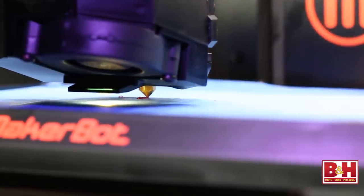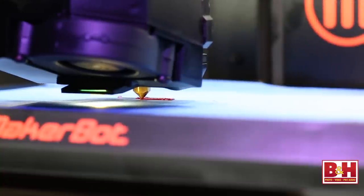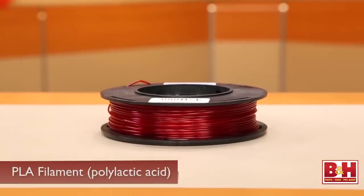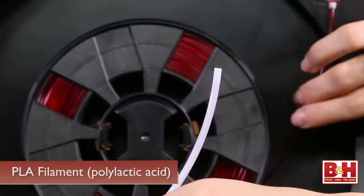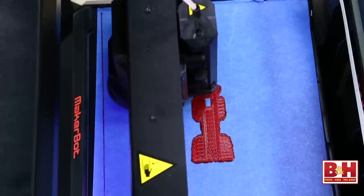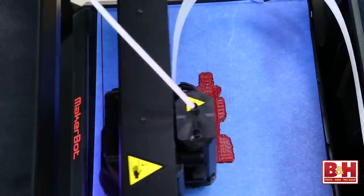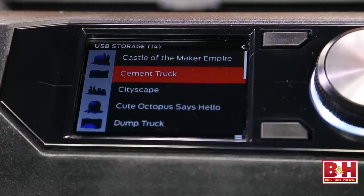So how does it work? Well, if you've seen a glue gun working, you know that a solid stick of glue is inserted into the back of the gun and passes through a very hot nozzle which both melts it and directs it toward the surface you want to target. A 3D printer does the same thing. You feed the material called filament into the printer and the nozzle melts it. Instead of you pointing the glue gun, however, the nozzle of your 3D printer is controlled by a very precise motor, and that motor is controlled by software. So before you print you need to give the printer a file containing a 3D design.